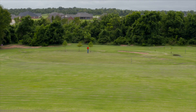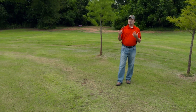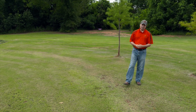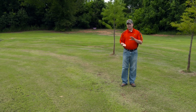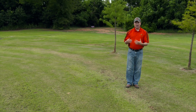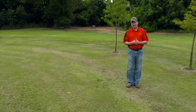Now we're at the bottom of the drainage at a large-scale bioretention cell that is collecting much of the water from the entire neighborhood. This is about an 8,000 square foot bioretention cell, located just outside of the 100-year floodplain, with about six inches of sand media underneath it and an underdrain system. Because it's lower down in the watershed and the water table is a little higher, the underdrain allows us to drain this within 24 to 48 hours.